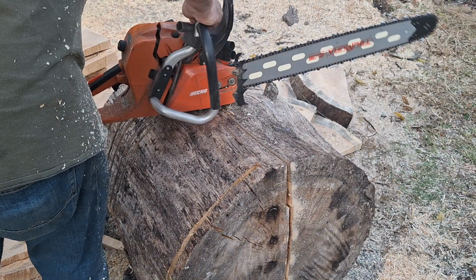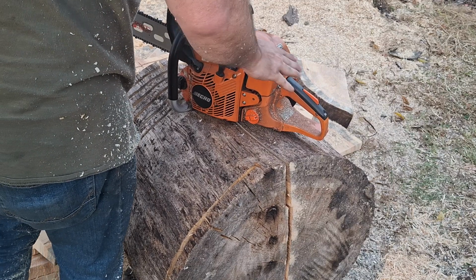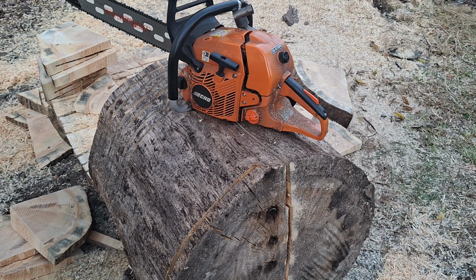This saw's been great. You can see how dirty it is. Just sits under the bench. I don't hardly use it anymore. It's one of the ones I don't wanna let go. I threw that stock 261 on Marketplace. I set it up with a 20-inch bar, skip chain 3/8, because I wasn't letting my other lightweight bar and 325 setup go. Because I sometimes run that on big saws on stuff that I can go on. They don't care what chain you're on.